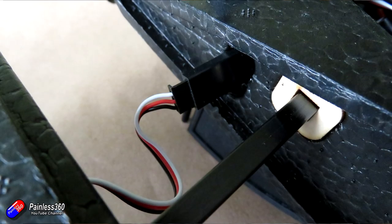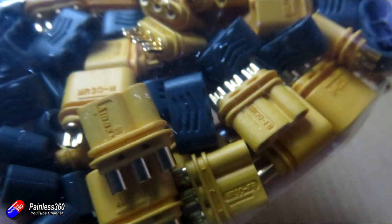So that's what I've done with my wing. I would pick the wing that's got the least number of connections and use something like these connectors — cut the wire in the middle and house the female and male so you can plug them together. Use servo-style connectors if it's only going to be a relatively small number of times you make and unmake them, or something like the MR30 connections if you need something chunkier. I've got a big bag of MR30 connections here because in future as I build other wings I'm automatically going to set them up to make the wings removable and quick to pop back in place.